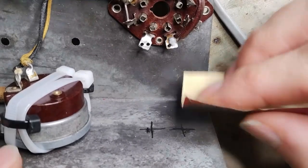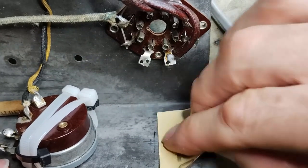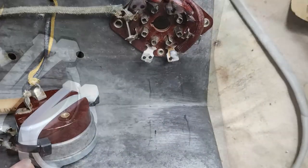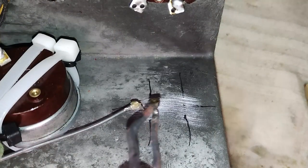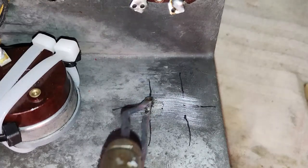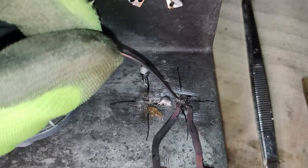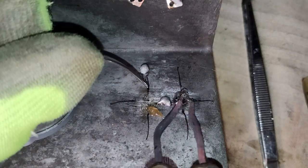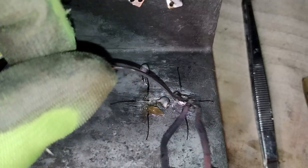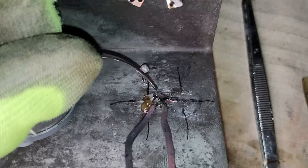In the original arrangement of this radio, there were no fuses. In this restoration, two fuses will be added. The chassis is still intact, and it was very carefully coated with zinc. Therefore, instead of making holes for the fuse holders, a couple of short standoffs are soldered in the power supply area. A special low melting point solder is used. It contains tin and bismuth, but it does not contain resin, therefore the flux must be added when using it.